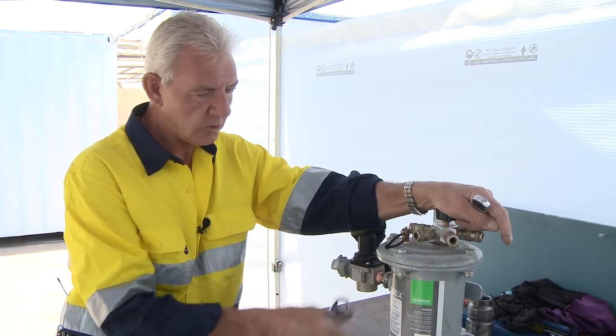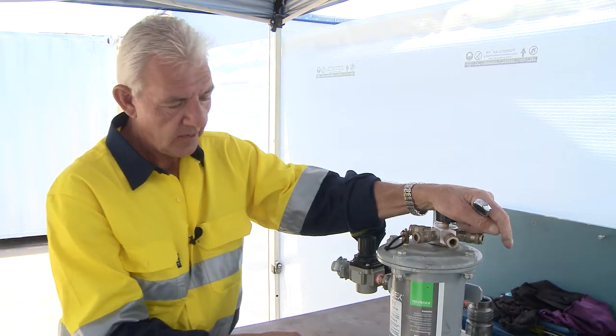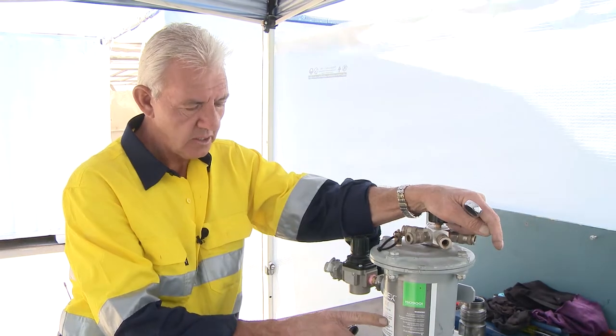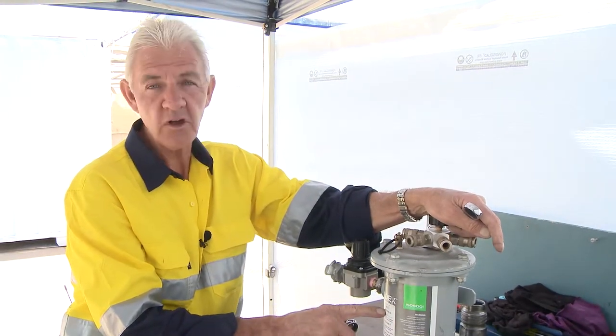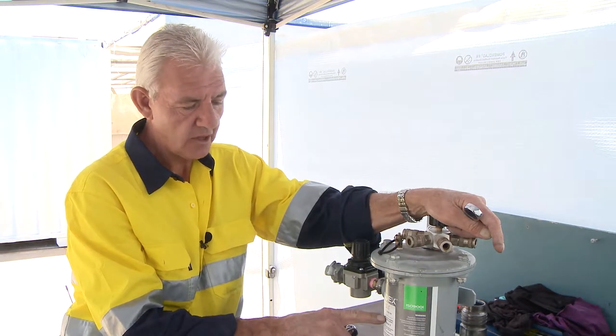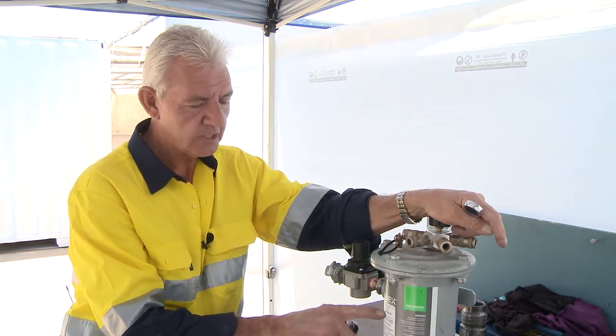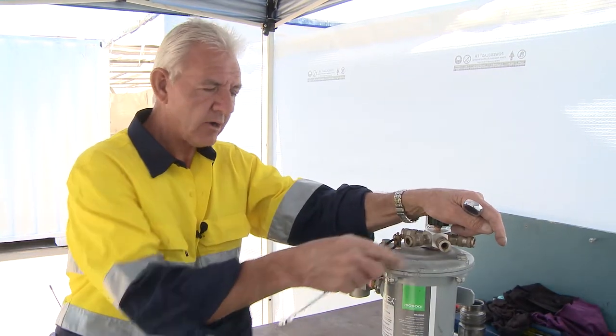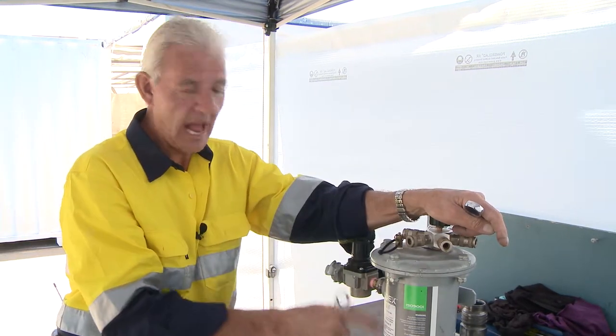With the ports open it will continue to work. If you don't use an air prep when utilising this piece of equipment, it will diminish its filter life — it cuts the filter life in half. So instead of changing it every 3 months or 90 days, you'll be changing it every 45 days, primarily because the coalescing filter can't cope with moisture.